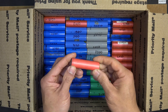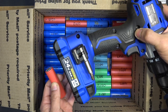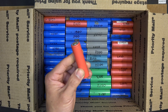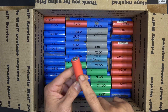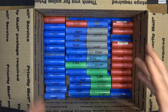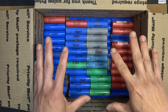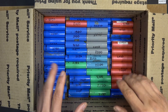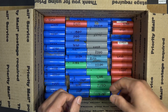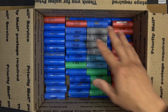As an example, this cell here comes from a power tool battery and can put out about 20 amps discharge rate. You cannot put this cell in the same battery pack as these low discharge cells. And finally, voltage: before you put all these cells together they need to have the same voltage. The easiest way is to fully charge them all to 4.2 volts. So those are the three important things to keep in mind before assembling the pack.